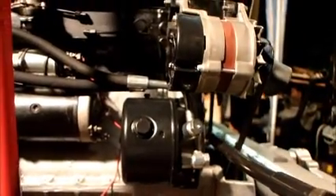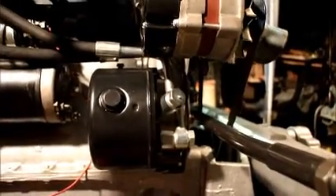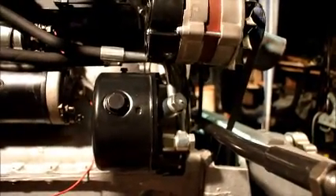It looks pretty nice under the dynamo. But the issue is it will — no matter what you do — it will touch the dynamo, so this is not good. That means I will cut this adapter, maybe two or three millimeters on the lathe machine. That is all — it's not really much, but it is not good as it is.